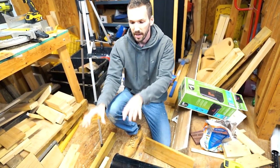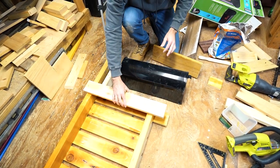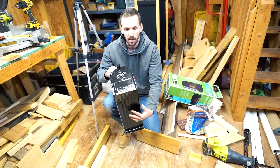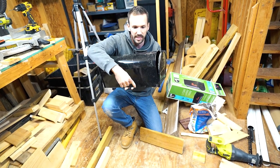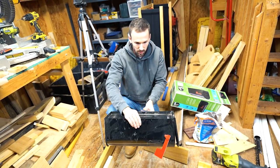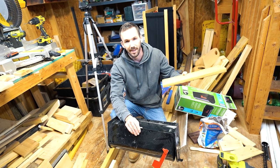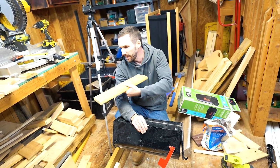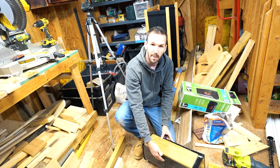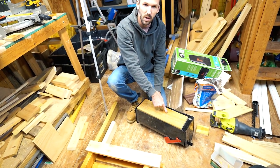The other reason we're not screwing in the other side yet is because I need to access underneath to be able to screw in the mailbox top. There are screw holes on the bottom, but it's hard to get a drill down in there. So what we're going to do is drill up — there's a side flange with screw holes. I'm getting a one-by-six scrap deck board, but you can use a large cedar board, fence picket, or plywood. The mailbox will be fastened onto here, and then I'll screw up into the piece of wood so it's all connected.